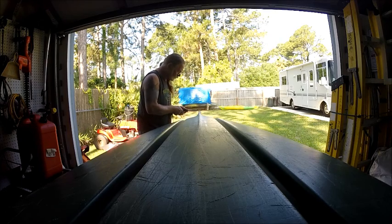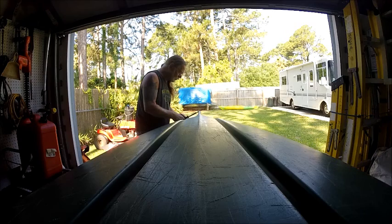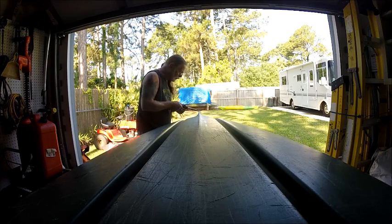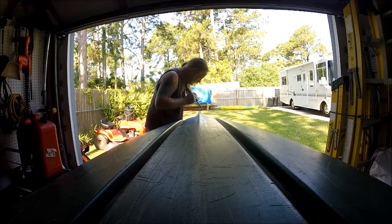As the next repair strip melts, I grab the welding iron again and move the heated material and start smoothing that out. After a few strips have been added to the worn side, the repair is getting more level, like the original shape of the keel. So I just keep tapering my repair material and building it up in the areas that need it.